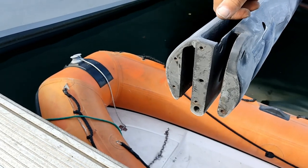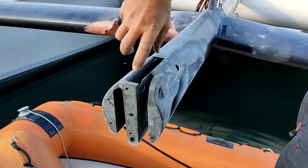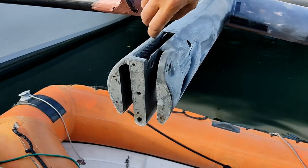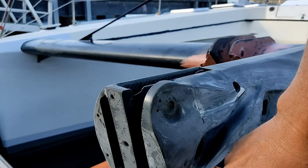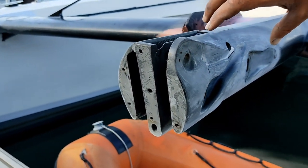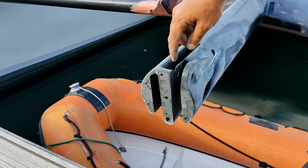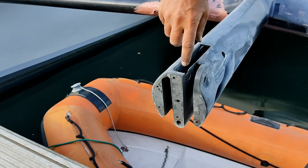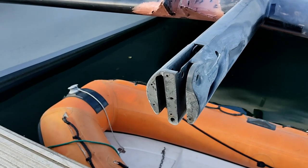It would come up the track, then he would lock the locking mechanism, which would lock the main in place up here. Then he would take the masthead halyard off, put it back into its original position, and come down with that masthead halyard. And when they went to drop the main, they would ease the boom, ease the vang, ease the cunningham, and then pull a little trip line, which would let go a mechanism in here, and basically the mainsail would fall down.